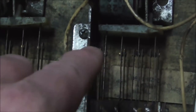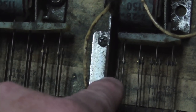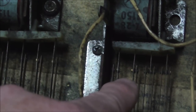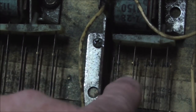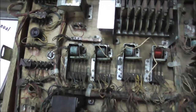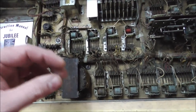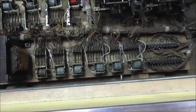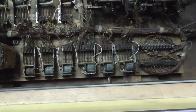To get these things going, all you have to do is make sure that every relay makes its switches change state every time: closed ones open, open ones close, make-break ones flip the other way. I'm going to go through with a little tiny dull file. You don't want to use a really aggressive file because it will eat up all your contacts. Just go through and get every one of those switches clean.